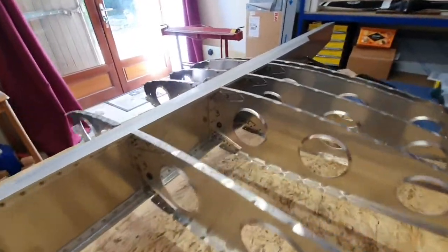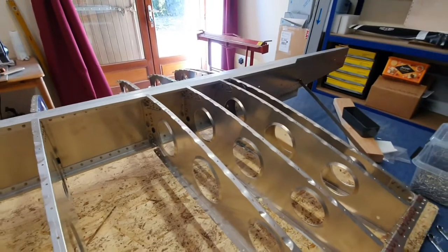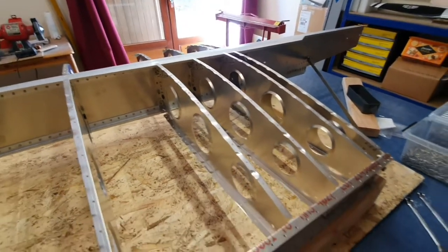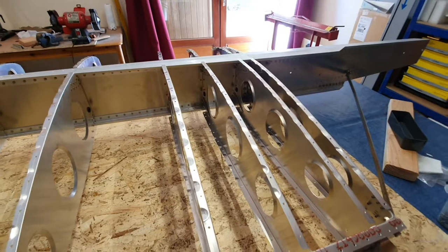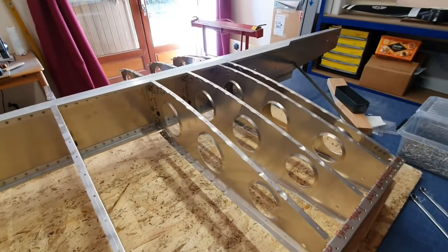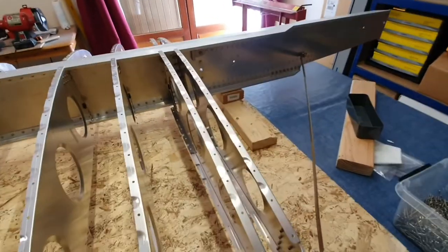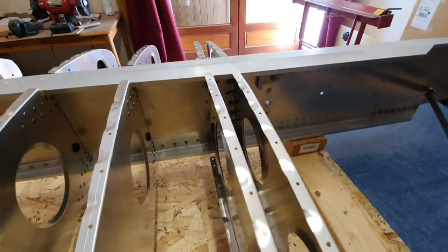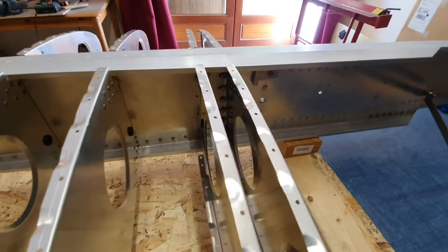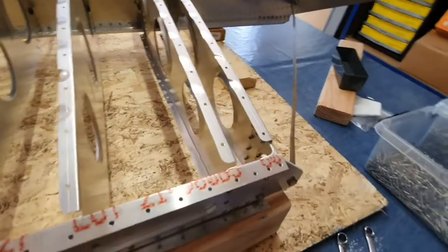The first four ribs are always a bit of a fight because you have to get the riveter into the right position — they're stiffer and less able to be bent out of the way for the riveter. It had to be assembled from the root rib onwards, because once you've riveted in rib number one you can't really get access to the bolts for the root ribs, so I started with the root rib.